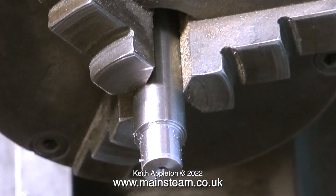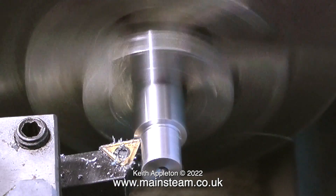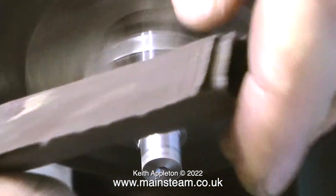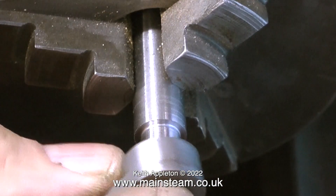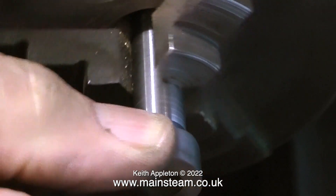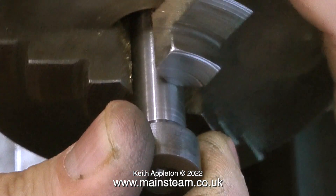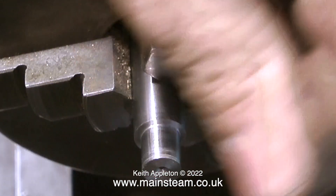The video is speeded up to get through this sequence more quickly, but you can see clearly how well this silver steel cuts. For the very last cut, as the cutting tool is up against the shoulder, I press the tool into the work to make a small groove. Because the tip of the cutting tool is rounded it won't give a clean face for the crank web to fit against. It's easier to press the tip in very slightly to make the tiniest of grooves — that way the crank web will perfectly locate against the shoulder.